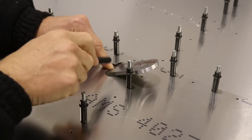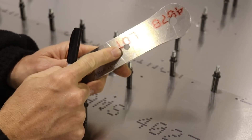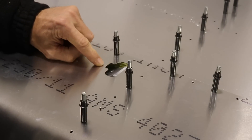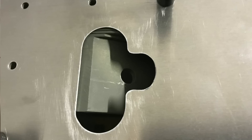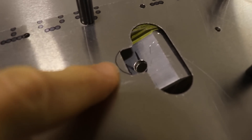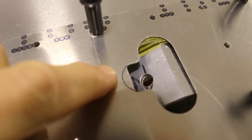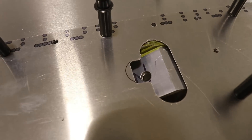The top, because you'll need to get to this from the top to get to the bolts. But in order to get to this very first bolt hole in here, to get to the bolt that goes in there, we need to open up this part of the opening just a tad. I have a picture on the screen of the other wing, and you can see how much I opened that up. I've drawn on the wing here this little arch — that's all I'm going to grind away — because with that taken away I can now get a socket in here to get to that bolt.